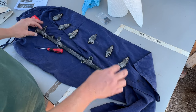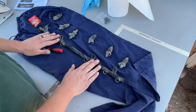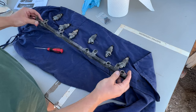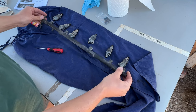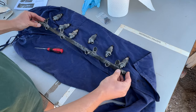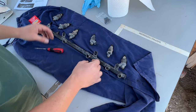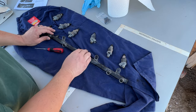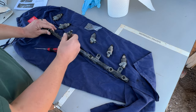I got the fuel rail and the injectors removed. The instructions say to slightly rock it back and forth while pulling, and the fuel rail should come out along with some of the injectors or none of them. I don't know when the last time this was pulled apart because it was extremely hard to remove. I was giving it a good pull and I'm glad I got it off without breaking anything. I inspected each of the injectors and all of them look really good — just a little crusty and dirty, so I'm going to wipe them all down, wipe down the inside of the fuel rail and where the injector goes into the manifold.